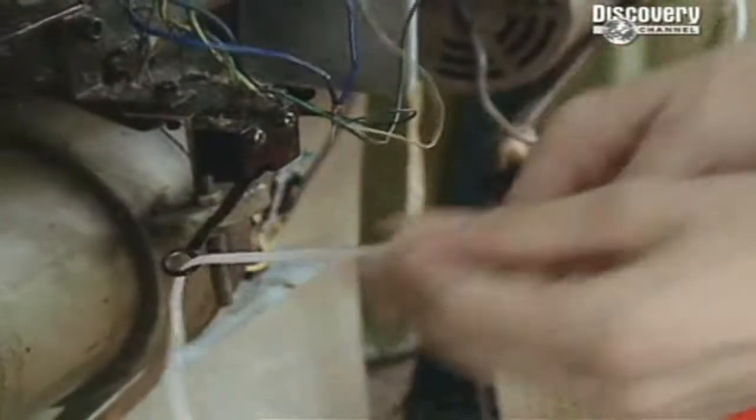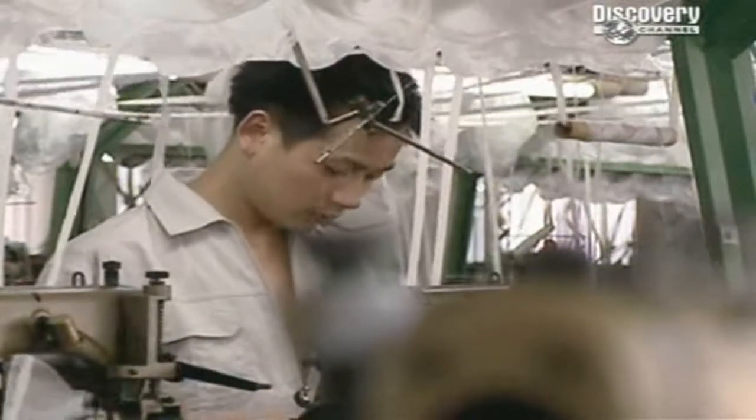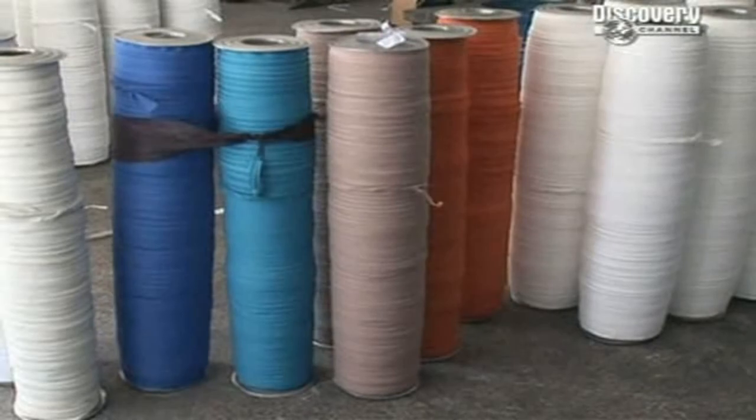Now it's a matter of attaching millions of metres of fabric to millions of metres of zip. And this is where both sides of the central cord reveal their magic. By being inside the looped teeth, the central cord is in the perfect place to sew the zip into the tape. The 2 sides of the zip are then threaded through another machine and sewn to the zipped up cord to create huge lengths of different coloured zip.